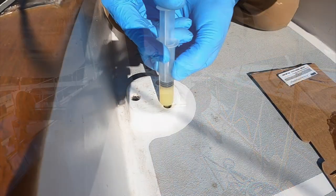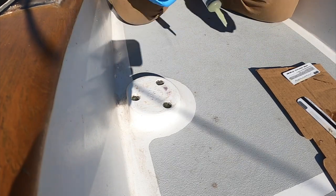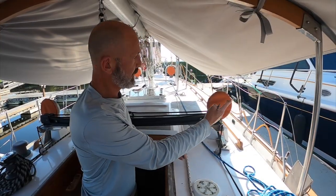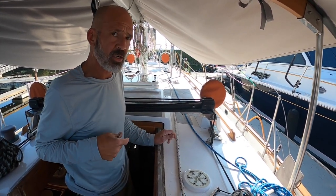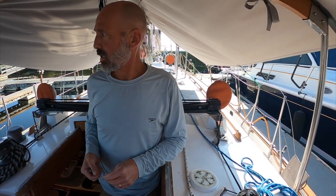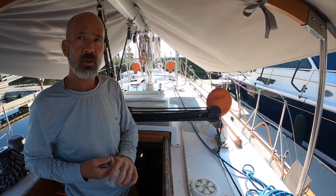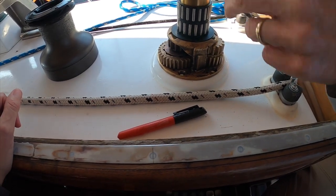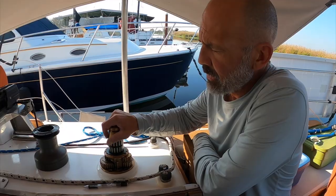The epoxy didn't take — there's too much water in the core. I tried to drill out and pot the coring in between the stanchion holes and the two deck skins, but as the epoxy was curing, the sun hit that side of the deck in the afternoon and water was just bubbling up, turning the epoxy cloudy. I need to flood it with acetone to suck the moisture out as it evaporates. I've got paper towels in there trying to wick out the moisture right now. I put the gears uphill so if I ever have to pull them they won't spill out over the sloped deck — and these are where I need to drill the holes.